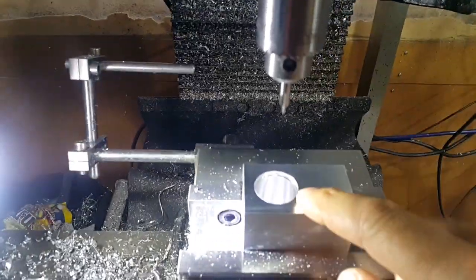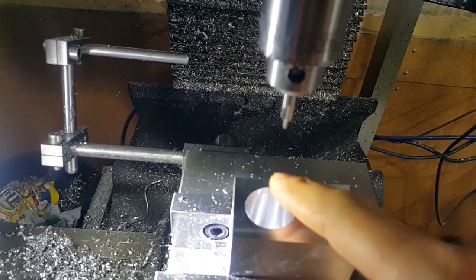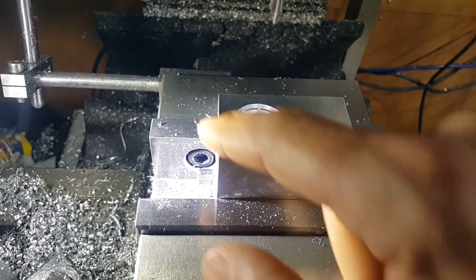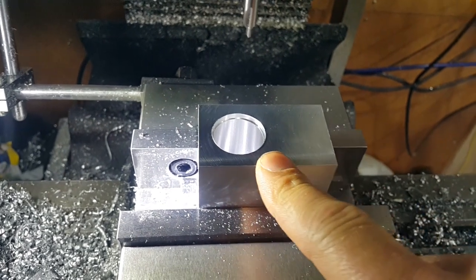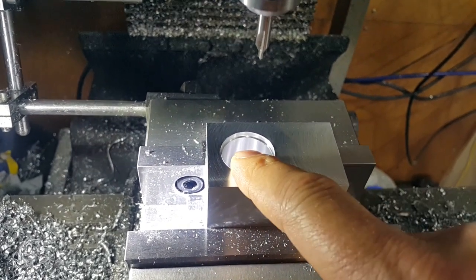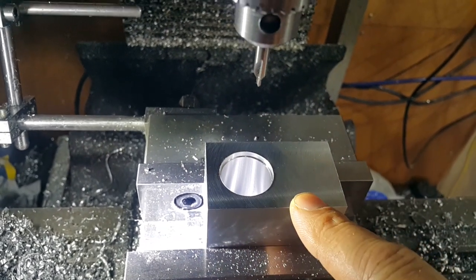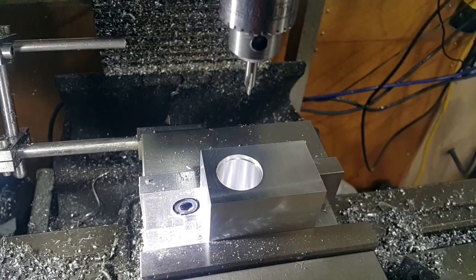The cylinder's all finished, all bored out to size, and we've also bored the lip here for the cylinder liner to sit into. What we've got to do now is put the bolt hole pattern around here to bolt the cylinder head down to. The bolt hole pattern has got six holes and we're going to be working from the center, then using the DRO to go out to each hole and drill those. We'll set the DRO up and then we'll start to drill those holes.